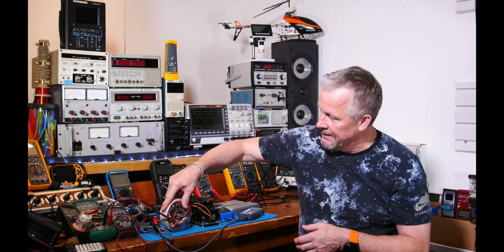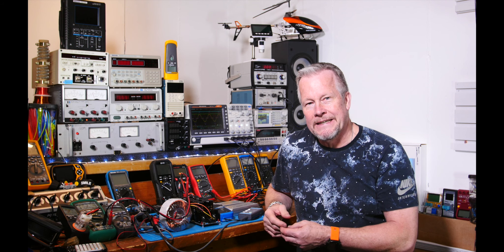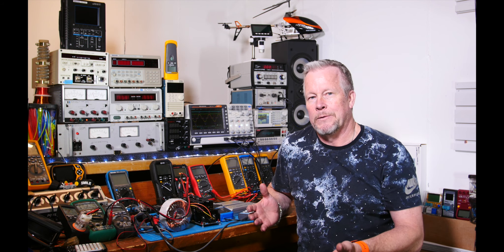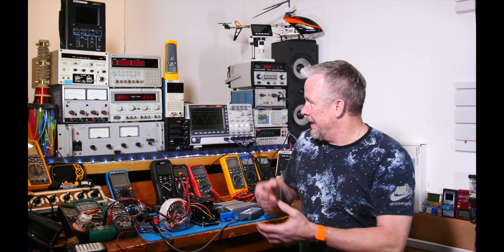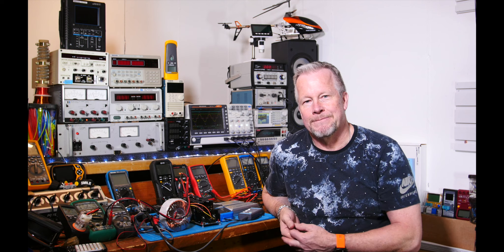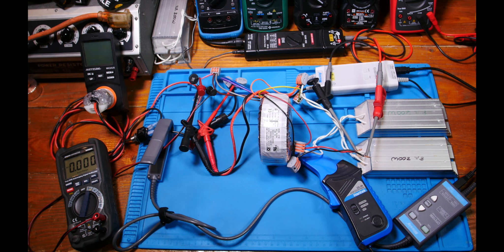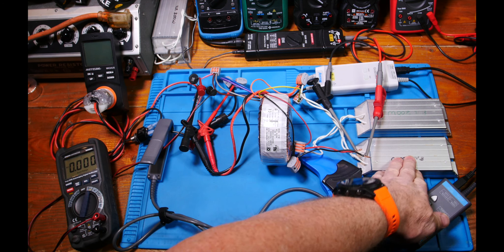I want to show you why we do that first — running straight into resistors — and then after that I'll put in the rest of the power supply: the capacitors and bridge rectifier to power the loads at DC voltage. I'll run them right on the output of the power supply, without the amplifier in there. I just want to show you what this bridge rectifier and these capacitors do and how they change things.